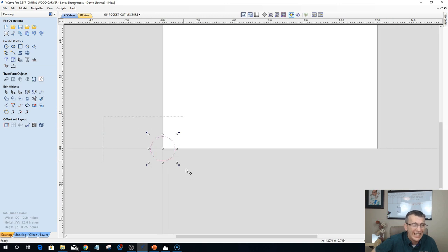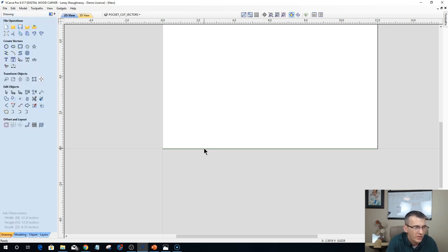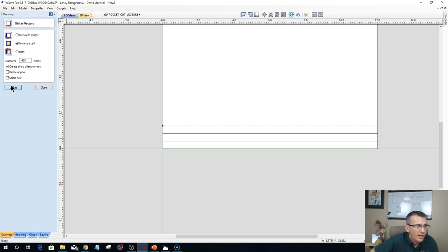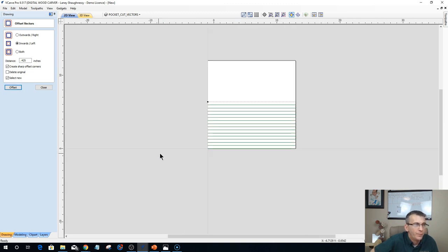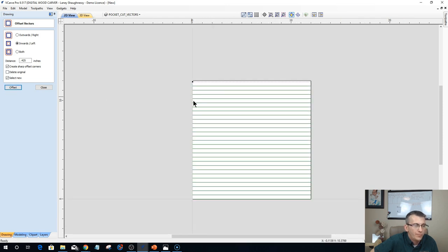And as far as setting, he's saying, do you have to set the start point for every line? That's a different thing. I thought he was saying reset the zero. Sorry, Jeff, that was on me. When I offset this, if I look at node editing, my start point is here, right? So with that being there, when I offset these lines, 0.425, when I offset these lines all the way across my board, keep going. All right, now,